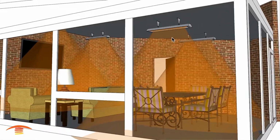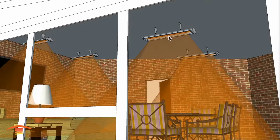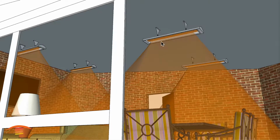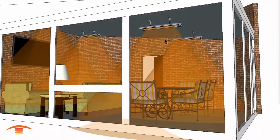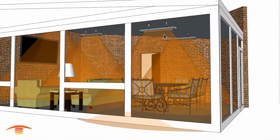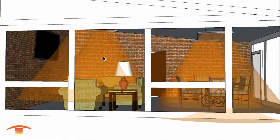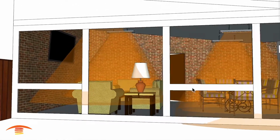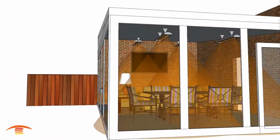Now, these are 5,000 watt units. You're going to want to either control them or have a duplex switch. A duplex switch will allow you to turn one element on, one element off, or both elements on, as well as you could put a control system in there. The control system will allow you to dim the system from 1% on to 100% on, and I would have 2 different control zones for this application. All right, so let's just say that you have some fans in here.